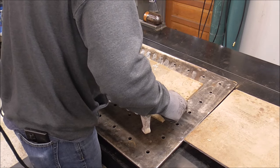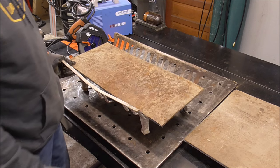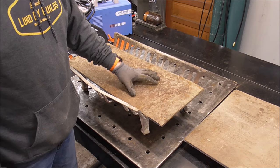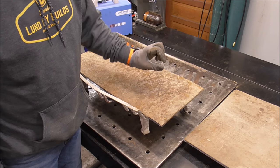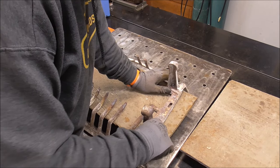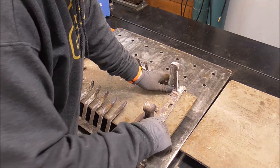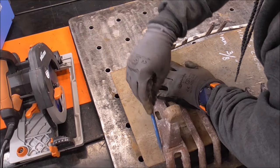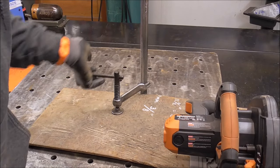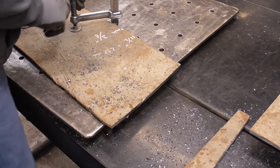Let's see how we did — yeah, that's going to work good. It's warped though, but we'll work around it and make it happen. I've decided I'm not going to do a double plate. Instead, I'm going to do strong backs on the back side, which is basically strips of metal welded in — it'll make it a lot stronger. I flipped it upside down and I'm just going to trace out the shape of the firebox, so I don't want to keep it square and have it not fit right inside the fireplace.